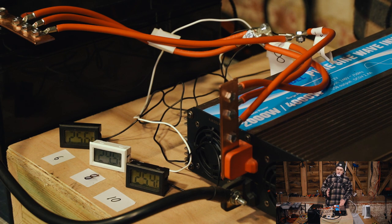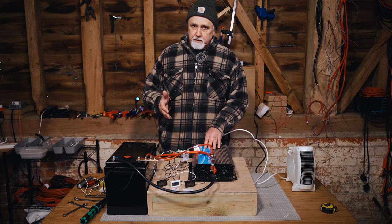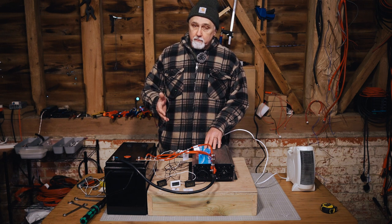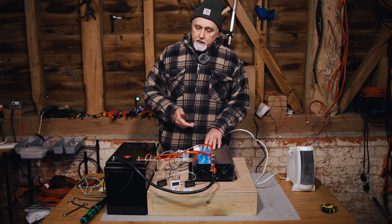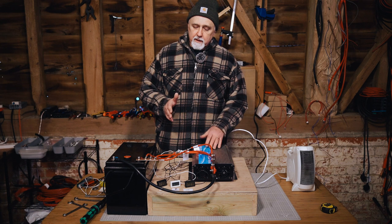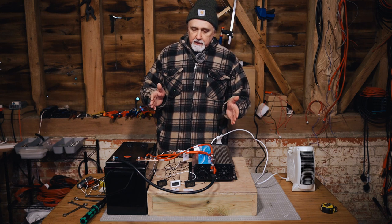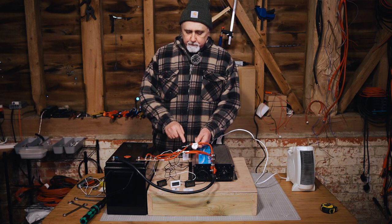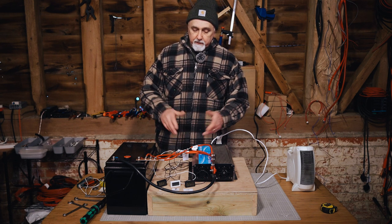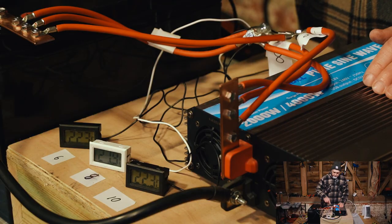One of the reasons we wanted to run this test at 6 was that quite a few of the battery cells we've tested, we felt 6 Nm was the tightest you could tighten things on the terminals. When we've gone over 6 on some cells, we've stripped them and had to put in helicoils and things like that. But now I'm curious — is the sweet spot 6 Nm or more? It doesn't really matter. Other factors come into play, such as the surface area making contact on the lugs, the way you've crimped them, resistance in the cables — you'd expect them to be identical. It looks like the 8 Nm is actually faring better than the 10 Nm in this test. At one stage we thought maybe we didn't tighten the 10 Nm enough, and we nipped it up a little bit and the temperature went up, not down, after about a minute.